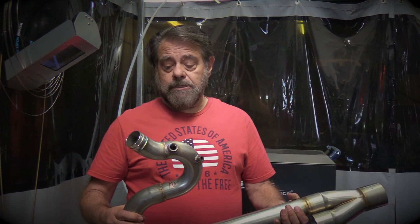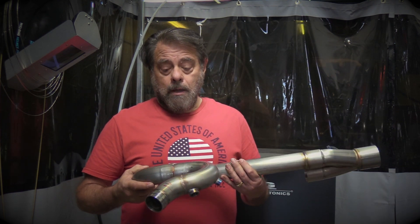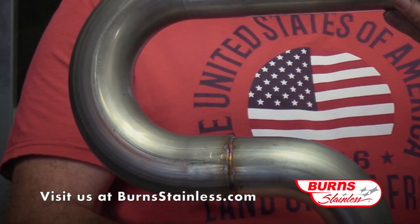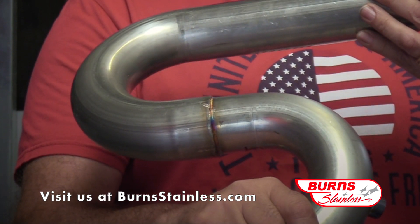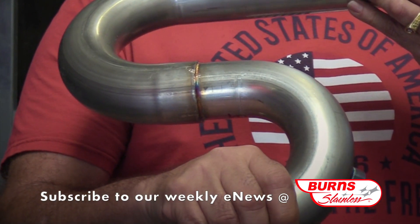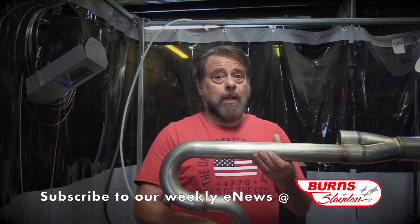Here's an example. This is a header that we manufacture for Moonshine Harley-Davidson. You can get in here and you can see the welding that we get on this. I don't have the exact time to tick available to me right now, but I'd say that we're at least five times as fast putting these systems together than we were with conventional TIG welding.